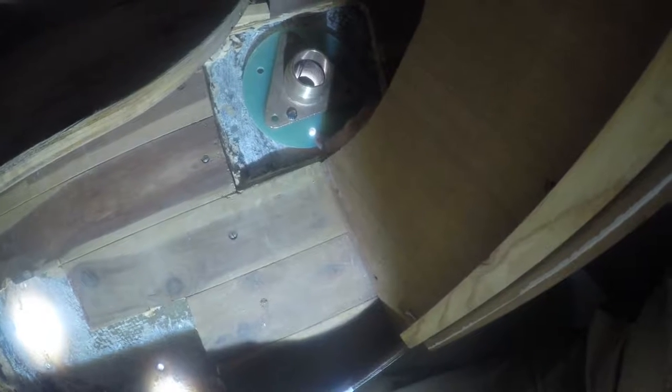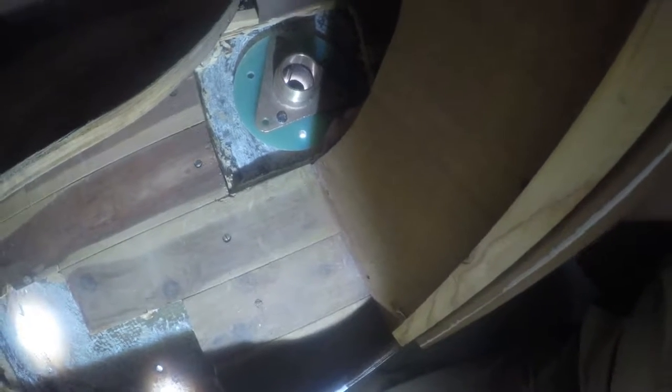Well, there's a problem right there. This is a test — if it had been the real thing, we'd be set back a bit. But this is only a test, so I moved my through hull to the other hole. That looks pretty good. I don't have an 11/32nd-inch bolt, so I'm going to grab my nail and put it through that hole there — it has conveniently lined itself up perfectly. Then I'm going to use my through hull tool to tighten it down and see what it looks like.